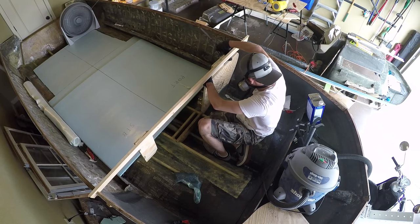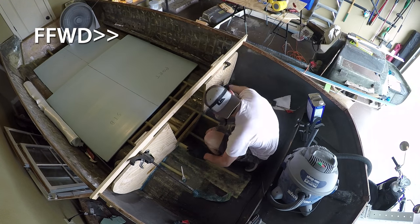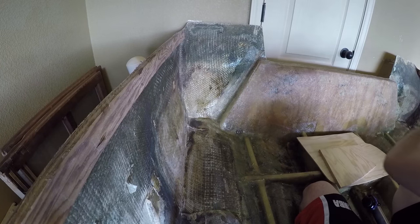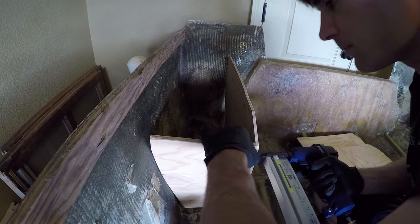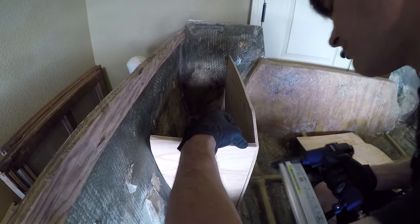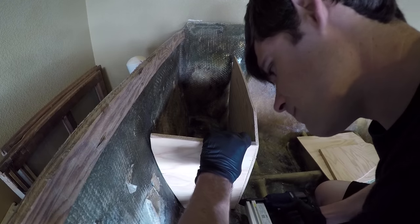With everything cut out, I moved on to installing them in the boat. I'll start with the cap supports, using the jig system I used when I did the stringers to hold them up flush and level. I used the jig to hold these cap supports in place, putting the putty on the bottom of them, letting them set up and kick off, and then I moved on to the back putting in the flotation boxes. Flotation boxes are a little bit different story — these things kind of sit around the transom and they've got these weird little notches in the back, which is how the factory did it. I thought I would replicate it because I wanted to keep the same dimensions and stay true to making this a restoration rather than just building everything however I wanted structurally.